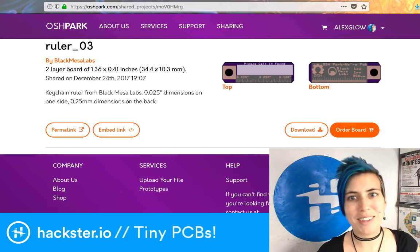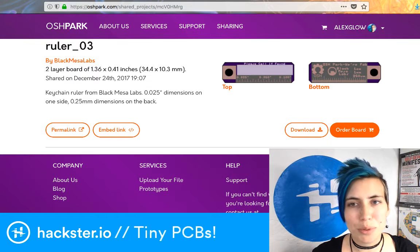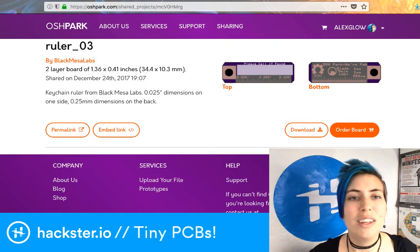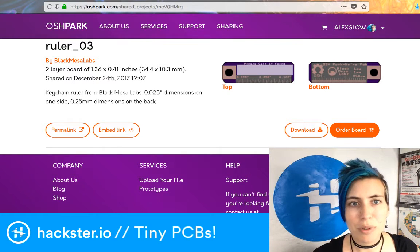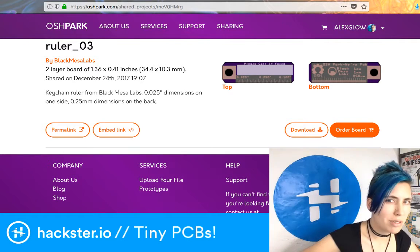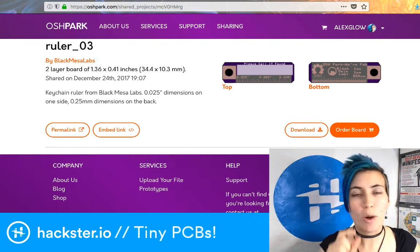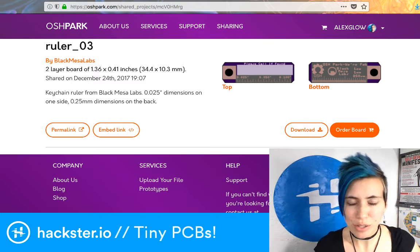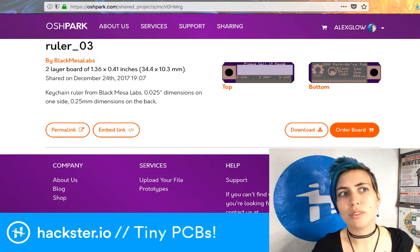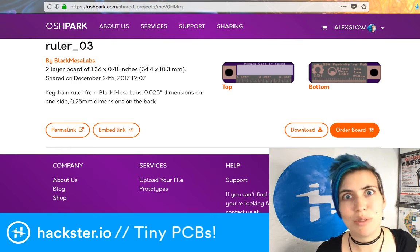The other one I lost has a little place for your name on it in silkscreen, and some of the solder mask removed so you can see the bare FR4 PCB substrate underneath. This thing has two different dimensions on it: 0.25 millimeters on one side, and increments of 0.025 inches, which is 25 mils. A mil is a thousandth of an inch and it's used in PCB design, for example when you're deciding how wide to make your traces. Those are essential measurements depending on what manufacturer you're using.